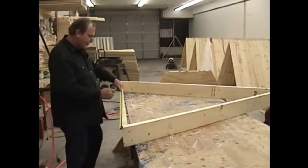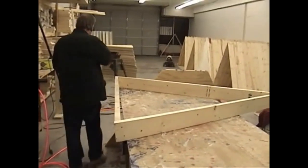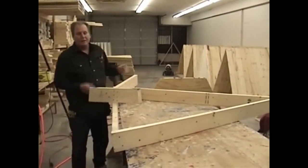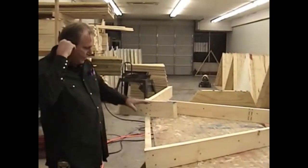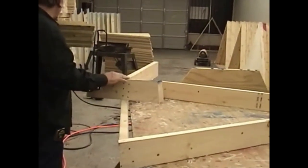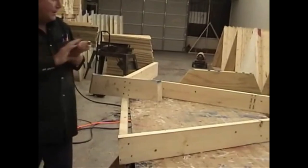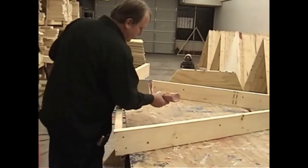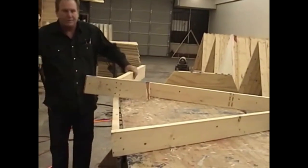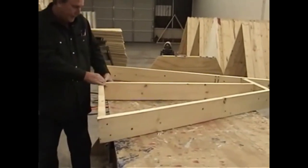I'll come and I'll mark halfway here. This is 78 and 8, so it'll be 39 and 16. This is our T. At this portion of the construction, we've assembled the carcass, we've drilled all the holes, the T's were made, all the interior blocking, and the plywood's got it. Okay, so now we're just going to put it all together. What I'll do is take my glue — a nice big healthy spread of that — and I set it right on that mark I made there. It's halfway.